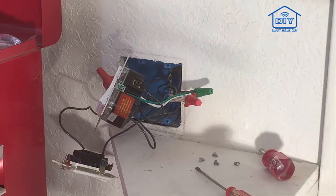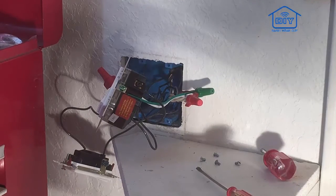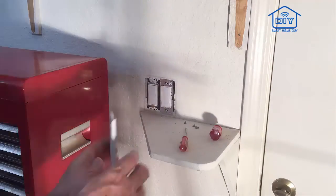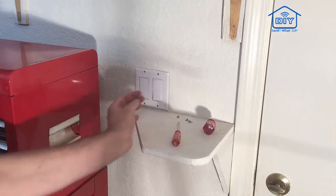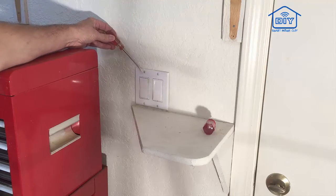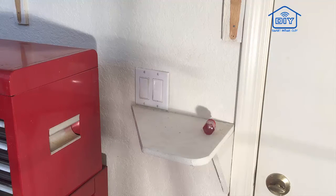Nothing blew up — the light came on. Click it off, good. Click it on, we're good. Let's put it back together. Shut the power off at the circuit breaker. Everything came on nicely — turn it off, turn it on, we're good. Now let's just reinstall the switch with the plate screws. One last thing — I always like to align the screws with the slot in them facing up and down. You don't have to have these things super tight. I think it just looks a lot nicer, it doesn't look so random and chaotic. That's it, switch is in.